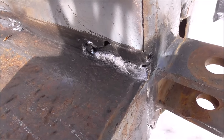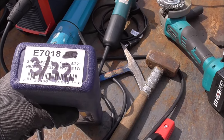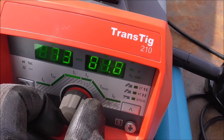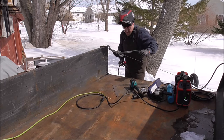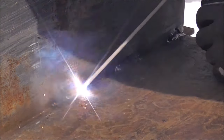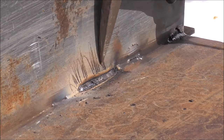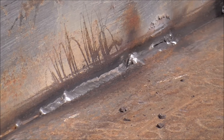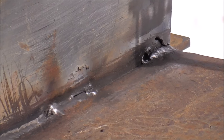That didn't do too bad but it's just a little too hot — I think that's where the edge of that sheet metal was torn. I've got some 3/32 7018, so this will help a lot, this will be much better. Let's try dialing this back to about 75 and see how that works. Yeah, that's working better — I actually went down to about 72-73 amps; that seems to be really the sweet spot right there. I'm going to continue that out, then release the come-along and get the backside welded out.